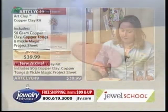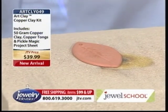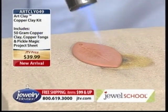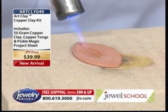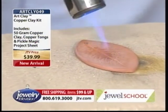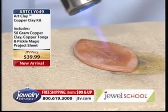Okay. Now, how long do you normally have to torch it for? You know, we got to get it to glow, and then once it's glowing, we go 10 whole minutes. Absolutely no less. Remember, copper needs a much hotter temperature than silver does, so I've got to get right up to it. Now, do you need to wear glasses or anything when working with the copper? The same safety things that have always applied to Art Clay Silver apply to Art Clay Copper.